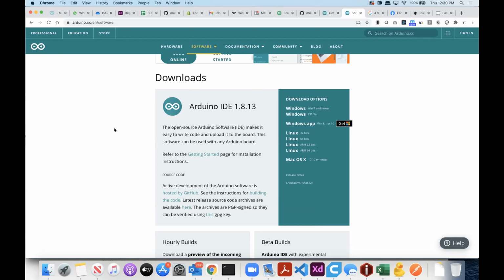Yeah, it's very overwhelming. I got it a couple days ago and started playing around with it. I used the simple Easel to do a test cut of an address sign, and it had some weird features around some of the lettering that I think was probably mostly an artifact from Easel, so I thought I would give Fusion a try and see if it did a better job with the cut path. I cut a box out around the whole thing and that was straight as a whistle, so it must have been some weird thing with the font and how it was telling it to cut, possibly.